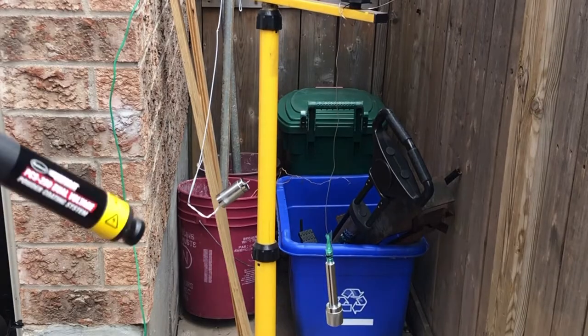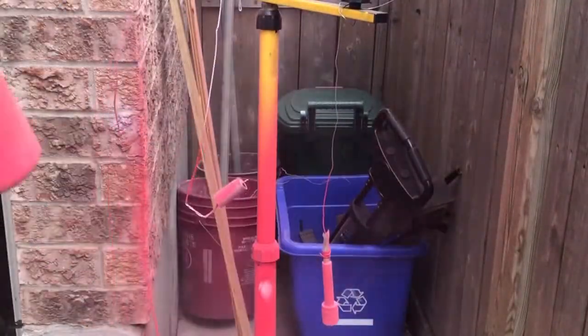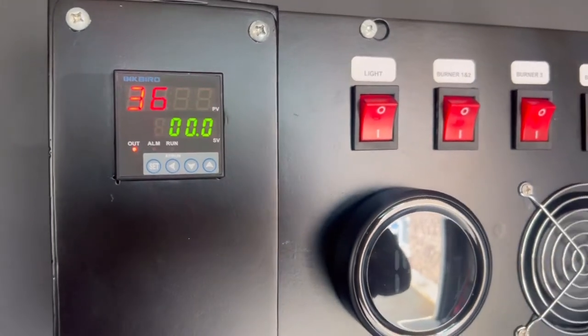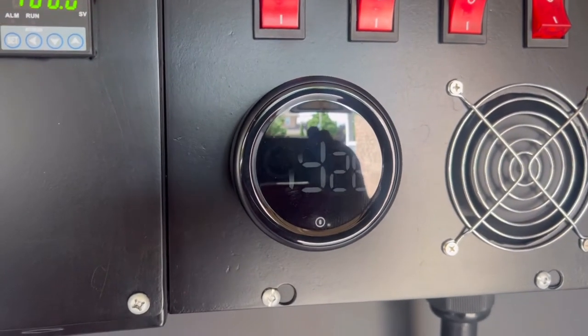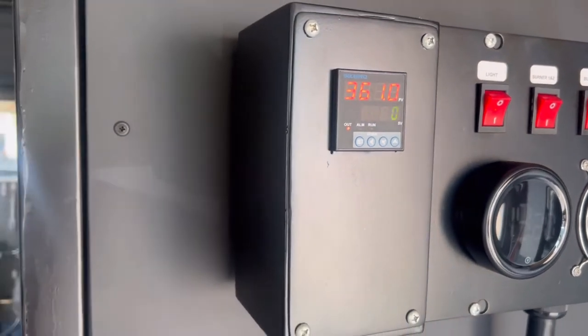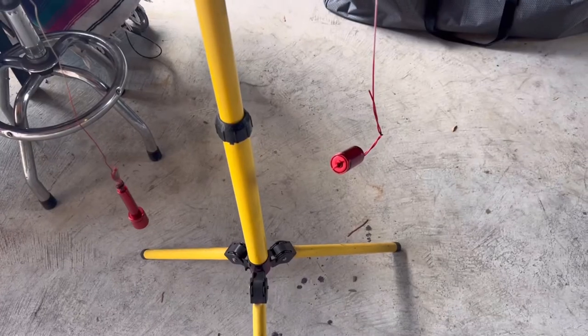Okay guys, so I've got the pieces in. Opening the oven dropped the temperature down to about 360 by the time I hung everything in there. I've got the timer set for 20 minutes, interior light on. It's got to hit 400 Fahrenheit — it's moving up. We'll test the pieces to make sure they hit that temperature and see how they turn out.